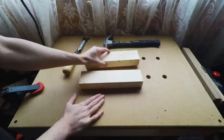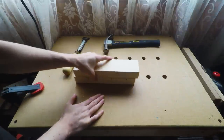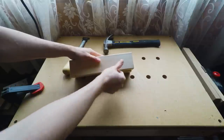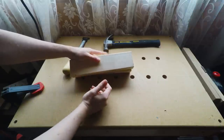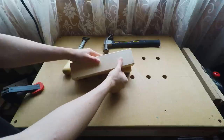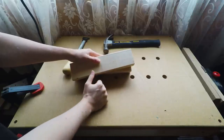Let's say you've got two pieces of wood that you want to join together and you want to put a screw through the face of this board but you want it hidden. The normal method is to drill a counter-bore hole that you can then fill with a dowel, pare it off, and sand it flush.